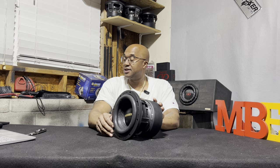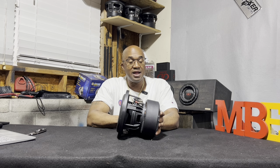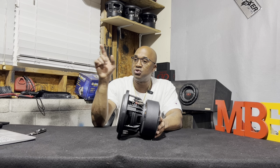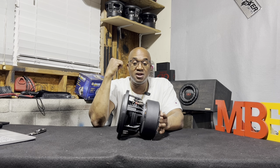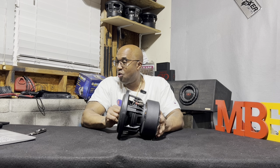The voice coil windings are made in the USA, so I guess maybe he's saying this is, he didn't say the voice coil. He said the voice coil windings. Now, there's a big difference between the voice coil and the voice coil windings. A lot of people get their voice coils out of PE, which is a very reputable company for its voice coils down there in Florida. He said the voice coil windings. The windings are OFC copper.